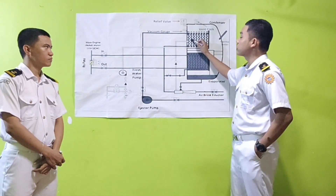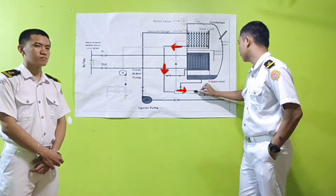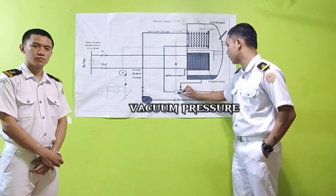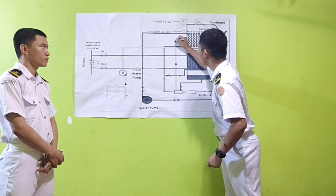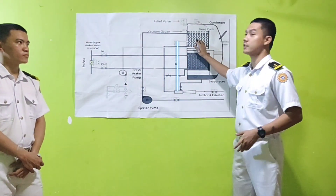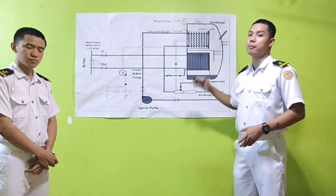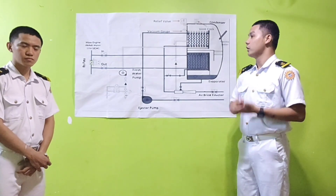The other portions of sea water that travel from the condenser will go through this pipe and be discharged overboard. Once the water enters the smaller pipes in this area, it creates vacuum pressure. This vacuum pressure leads these pipes to suck air or gases from the condenser, making this area of sea water less in pressure. Less pressure means it will be capable of boiling at 70 to 85 degrees Celsius of temperature.